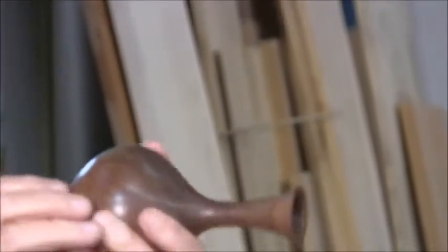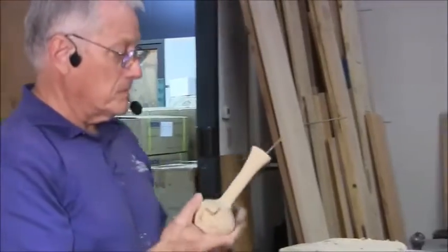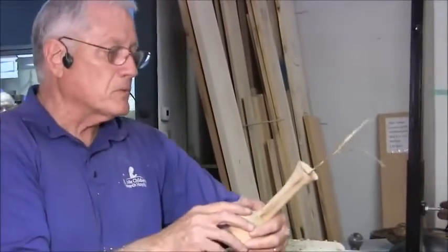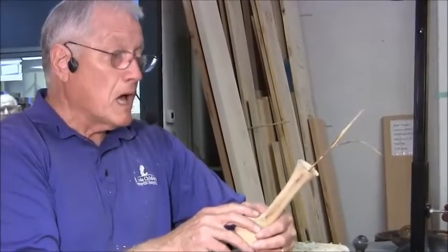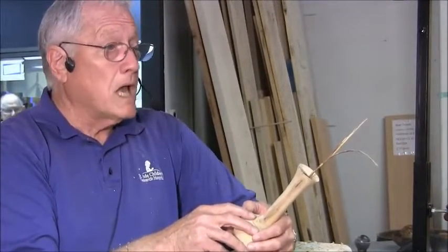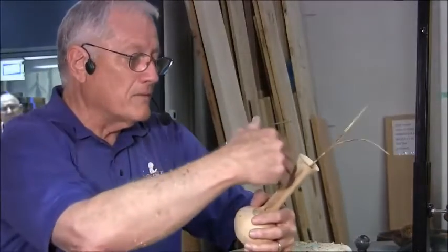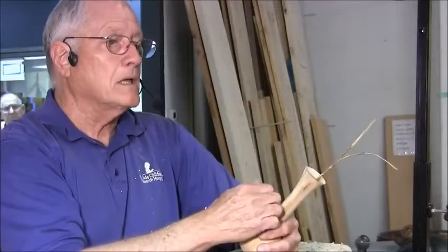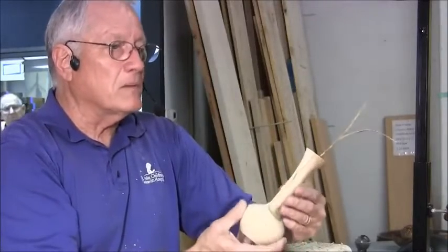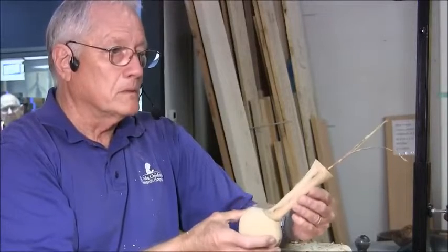If you elect to do these things, and especially with maples or hackberries or whatever wood you want to use, I would recommend you not try to finish them. I'd also recommend you try to use the gouge where you get a nice clean cut, because sanding isn't all that much fun on really wet green wood.